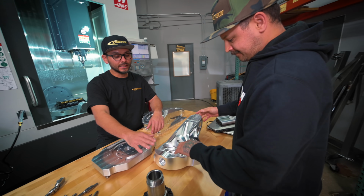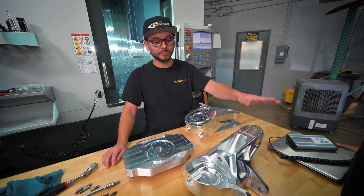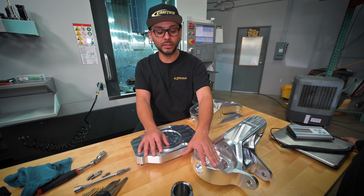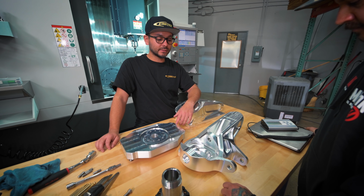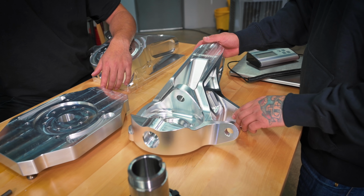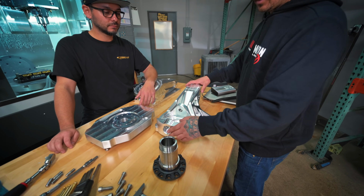So yeah, and with this, at least we can get every side of the spindle. So every single side was machined. There's not one spot that wasn't machined, and there's no deburring. So this is straight out of the machine. There's literally no hard edges. It's all soft to the touch. So that's pretty nice. Basically this will just go, we'll get our inserts in it, and this will be able to just go straight to a truck, or straight to anodize and then on a truck.